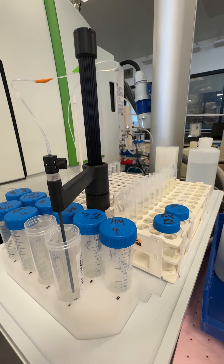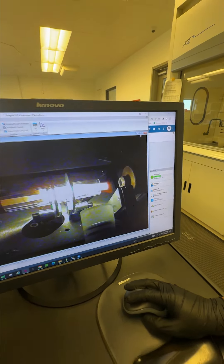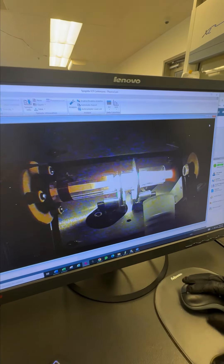That liquid is then injected into a plasma that's at about 6,000 degrees Celsius, or about the surface of the sun. That then splits everything down into individual atoms, and the detector on this one will actually measure what's called a photon, which is a light that is released after that atom has come back into a calm state. We can then use those counts to determine how much of that mineral is in the product.